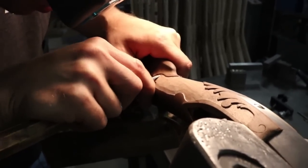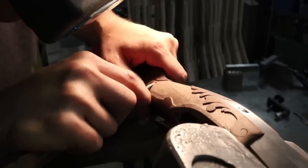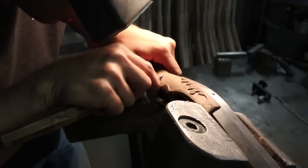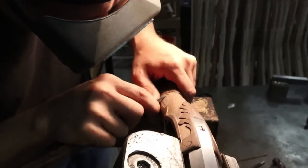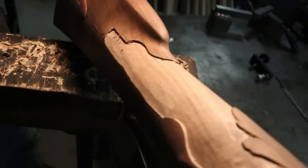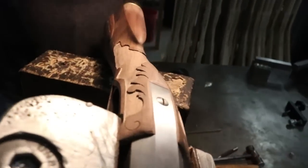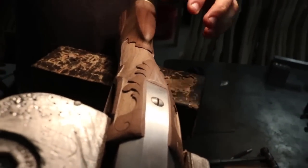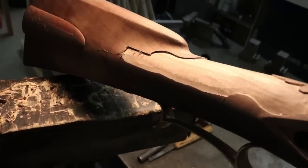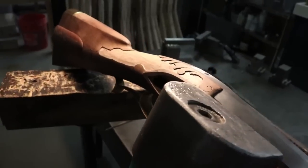The tendency for those getting started is they might find the control of the tool to be hard or difficult, so there's a tendency to think they can get the sandpaper out or little riffler files to make up for it — and it's not really a great practice. On some big open areas like this, there's nothing wrong with using a file — I probably will use a file down the wrist. But in a lot of other areas you just can't get a file in. It's better to learn to slice the wood off cleanly, be able to read the surface, and be able to level the background out.